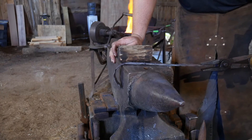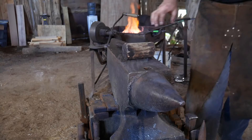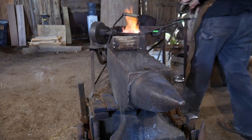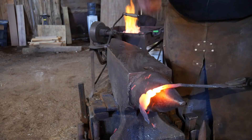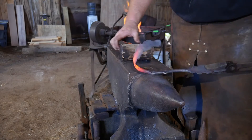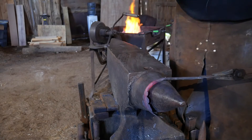If you don't use a wooden mallet and decide to use a metal hammer, you need to hit to the off side of the anvil, not directly on top - because again we're trying to form, not forge at this point. We're going to get that heated up again and keep bringing it on around. The next piece needs to come around the opposite way, and then we're going to pry the pieces to where they need to be to have the right amount of arc and curvature. We don't want to have a bunch of kinks in this leaf - it should be a nice smooth curve all the way throughout.